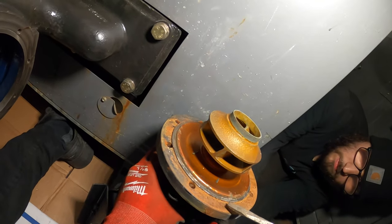We already got 138 degrees out, 139 — and this is set to 140. We seriously need to order a cover for this. Anyways, this came out really good — new header, new gasket, new gasket for the pump, new hot surface igniter. It's actually heating up now. When we came here and shut this down I saw four flashes indicating igniter failure — and now this thing is running. We got all six boilers up and running and that's a beautiful thing. If you found this video interesting or helpful please drop a like, comment, and subscribe — I come out with new videos every week.